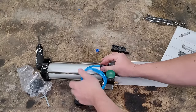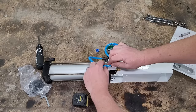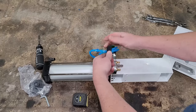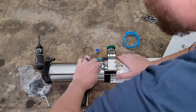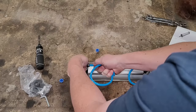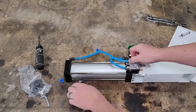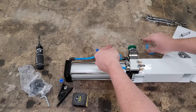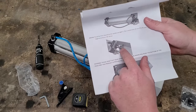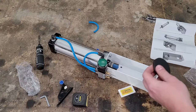This is a little swivel joint so hold it steady as you plug it in. We don't want to kink our lines at all. Put a thumbnail right here and take the cutter to get a nice square cut, then push it in. Take the remaining tubing, seat it in this fitting here, run it to about right here. Now thread the little head onto the end of the plunger.